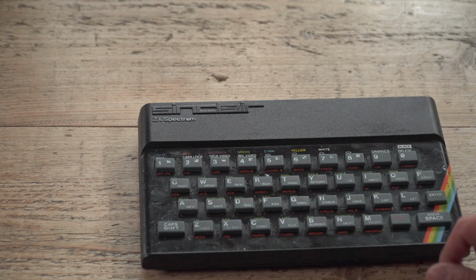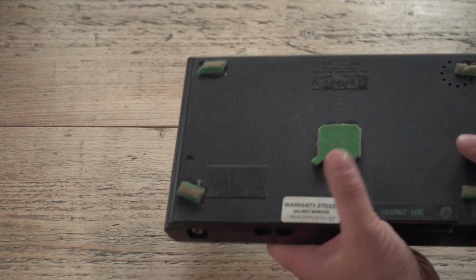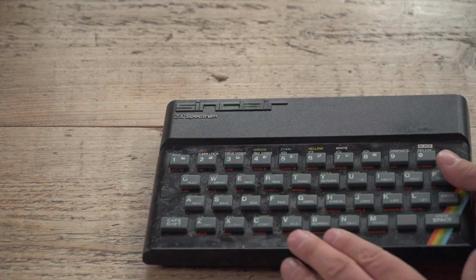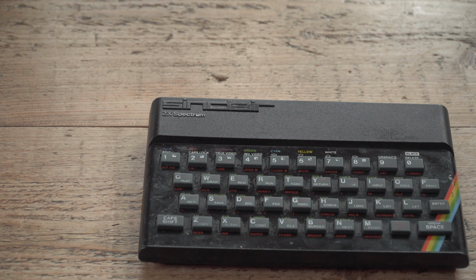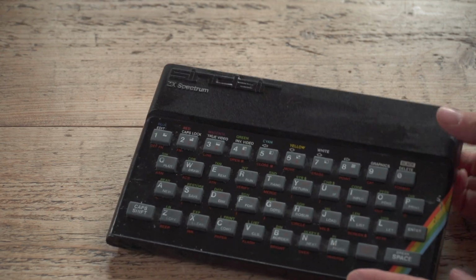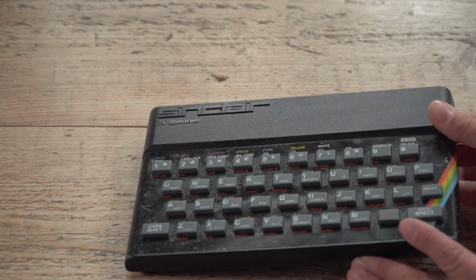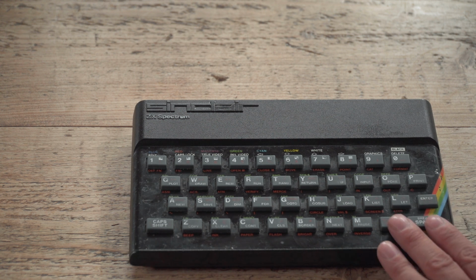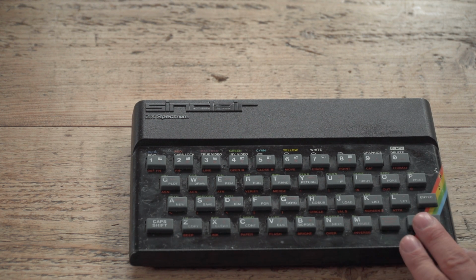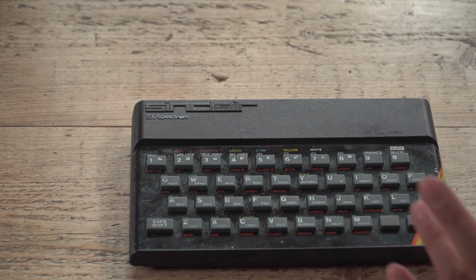So what we're going to look at is sprucing this up, getting this rubbish off the bottom, sorting out this messy faceplate, cleaning up on the inside, and the edge connector as well, so that's horribly messy, and generally making it look good. And I'll also show you what caps you need to buy, but we're not going to install new caps. Today I'll do a composite mod. I think that's probably a separate video to keep the length down.